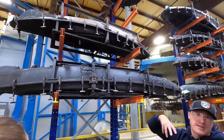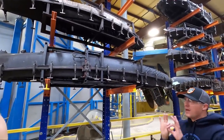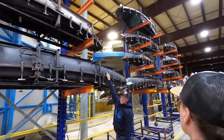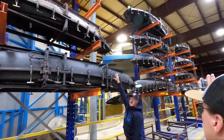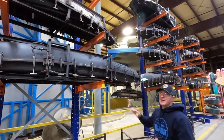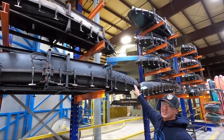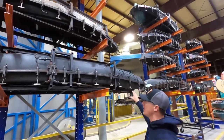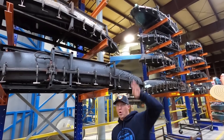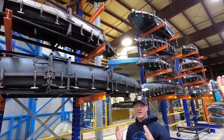Our engineers make a foam replica of the boat and iterate on foam using a big CNC machine to carve out the shape. Then they apply a Line-X material — like a truck bed liner — and test it, probably 20 times before they dial in and send the finished mold to the foundry to get cast. When the boat comes back, they run tests to ensure uniform plastic thickness throughout. If it's thin in spots, they add heat rods that draw heat to those areas and help the plastic set up uniformly — especially in complex molds like the Autopilot with hard 90-degree corners.